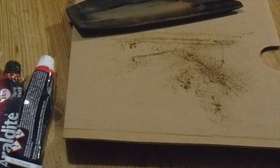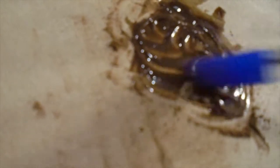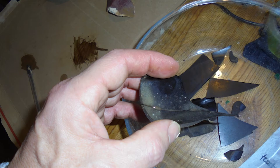One thing I tried which worked quite successfully, so the glue didn't stand out as much because it's quite a yellowy colour, is I sanded down some of the Bakelite and then mixed that with the Araldite before it set, and also used that to fill gaps because some of the holes are just so small and complicated. I couldn't fit all the smashed Bakelite back, so I had to use resin to build up layers to fill the holes.